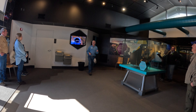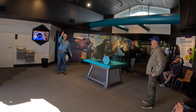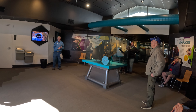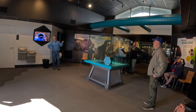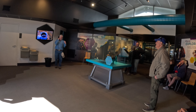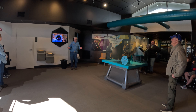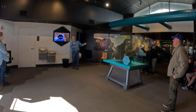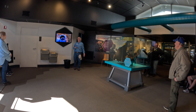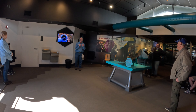In the case of the Hobby-Eberly Telescope, we take 91 mirrors just like the one on display here. Each mirror measures one meter — or 40 inches — across flat to flat, and is made out of a high-tech glass called Zerodur, made by Schott Glassworks in Germany. This material does not expand or contract with changes in temperature — we say it's thermally neutral. It's a very expensive material but highly prized in telescopes for that non-expansive property. To hold each mirror in place with 90 neighbors around it, we have a turquoise network of steel pipes called the mirror truss. The problem is that ordinary steel expands and contracts with temperature changes, pushing or pulling mirrors out of alignment.